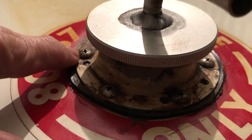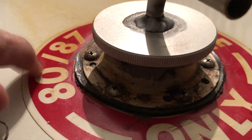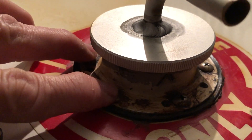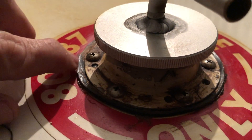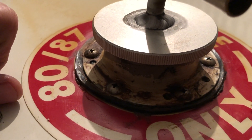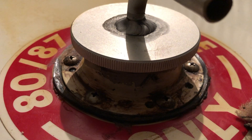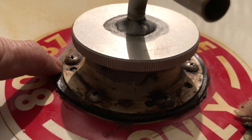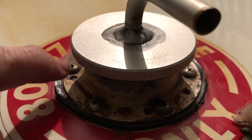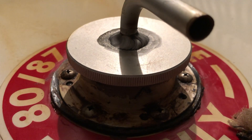So there is a fix for this. Part of the problem is these screws — this metal that the fuel tank is made out of is so flimsy that even if these two screws do get a good seal, it's going to leak between the screws. And all there are is Tinnerman nuts on the backside of these screws, which I find crazy. There is a fix and Billy Carter actually came up with it. He has a really good fix and I have some pictures of something similar that I made. So let me show you what I made per Billy Carter's idea.